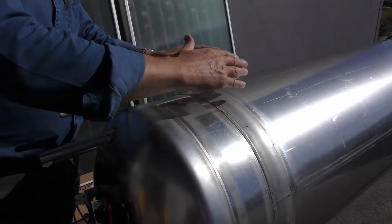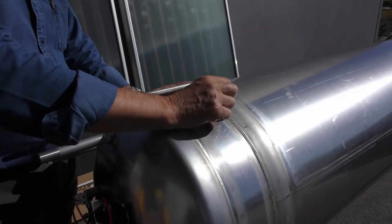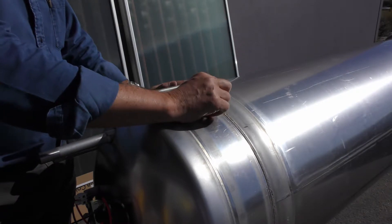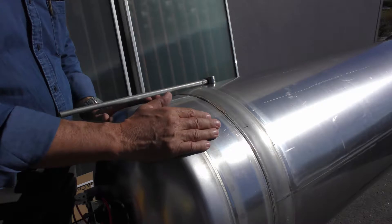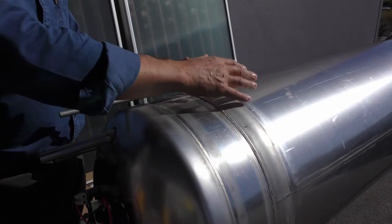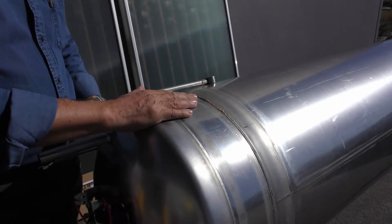The jacket or mantle is a cylinder welded around the full circumference of the main potable water cylinder, used for the connection to the collectors with heat transfer fluid passing through it. This jacket ring sits about 3mm off the main potable water cylinder. Anything that comes in contact with the potable water is 444 or 316 stainless steel. The main cylinder is all 444; some pipes which need to turn are 316. The main heat transfer process works through this jacket, which is 441 stainless steel welded onto the 444 potable water cylinder.